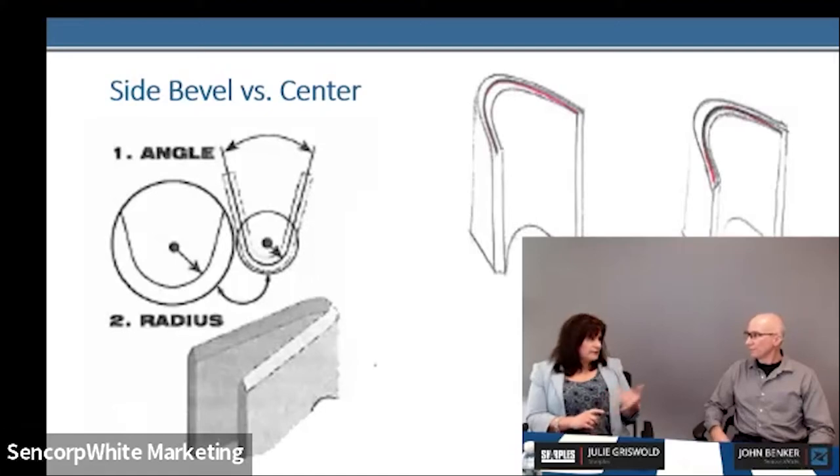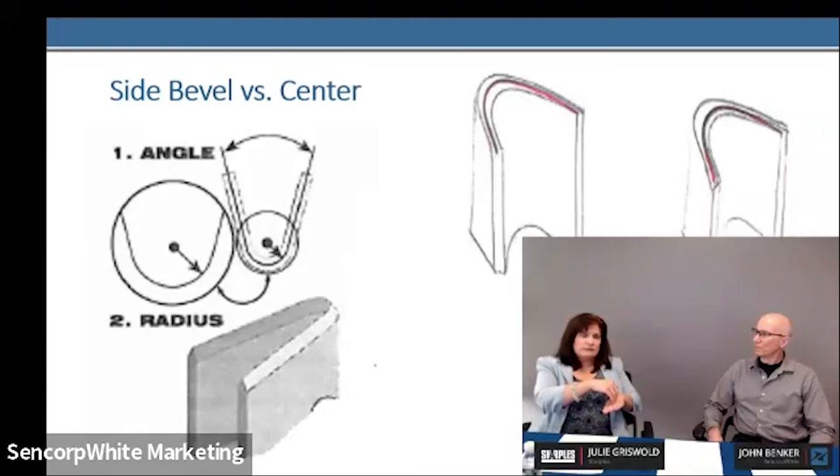When you're laser cutting the board, you can't just throw it on the laser and press a button—it is a skill. If you have a tight board and a burned curve, you're going to get high spots and low spots. The board is really a template to hold the geometry. The die kind of floats in there a little bit. If you have a complete closed geometry like a rectangle, it will settle in too. You need it to be a little loose so that knife, well supported, can settle into the backer plate.